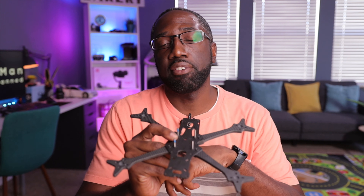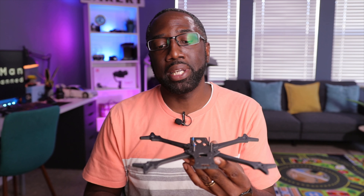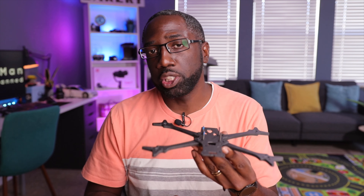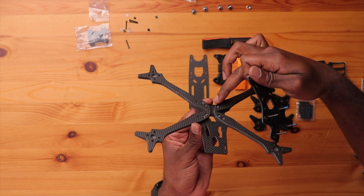Now this brings me to a really important point. If you are building your drone right now, this is a crucial step because of wire management. We talked about this being a clean build — the aesthetics on this drone are really nice. By hiding the wires, you have to plan ahead before you assemble. Before you attach this sandwich plate to the bottom plate, this little tunnel right here is where you're going to route your wire for your camera. If you're using a digital camera like HD Zero or DJI, it's a pretty wide connection with maybe 15 or 30 pins — like a MIPI cable — and it won't pass through here after you put the two plates together. So if you don't get this step right, you might have to remove the sandwich plate and reroute your cables.